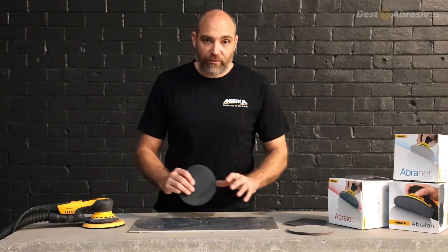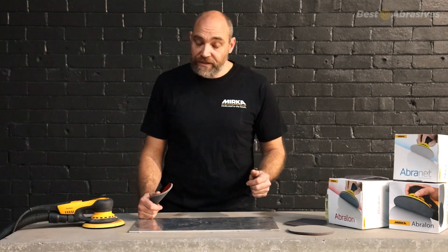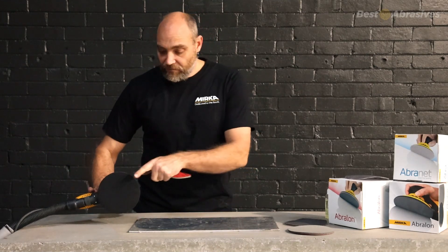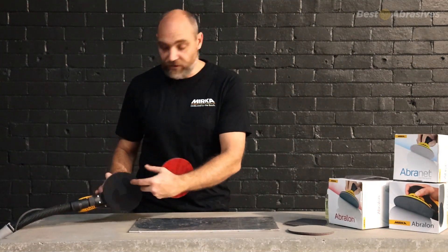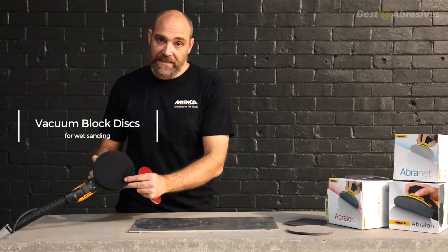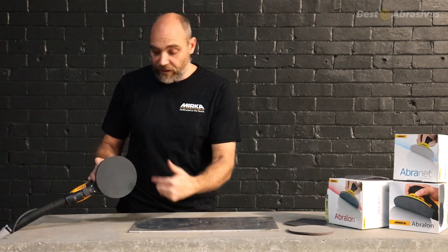A couple of methods to polish and sand aluminium: using a light machine oil or a spray of kerosene works well to lubricate and also helps the longevity of the disc. The other thing you need to consider is not to get the oil sucked up into the sander, so turning the dust extractor off. You can also get a padlocker, which is basically a pad saver without the holes, and that will prevent any moisture or oil going up into the sander.